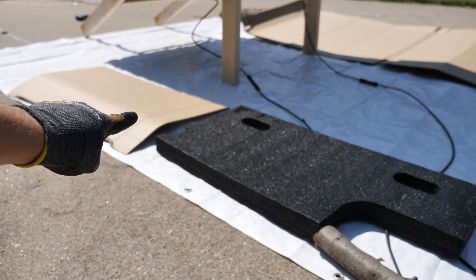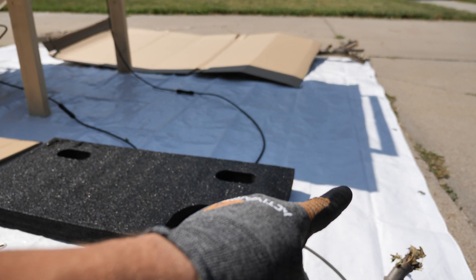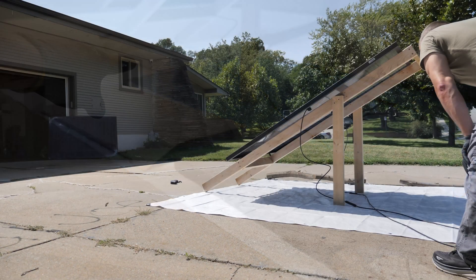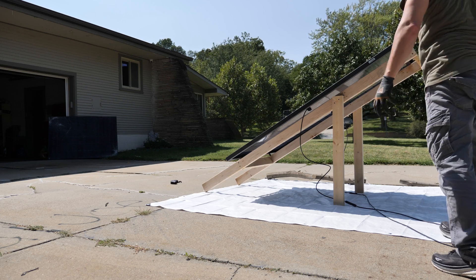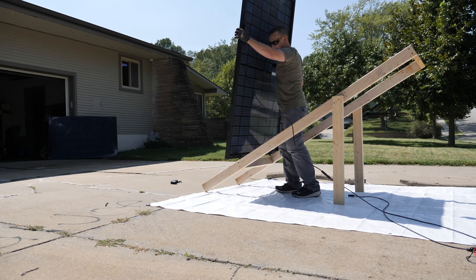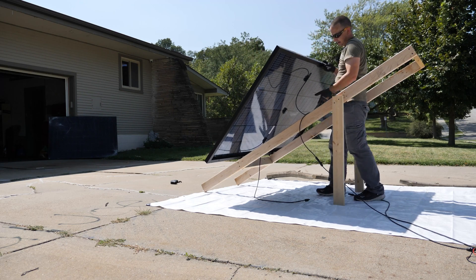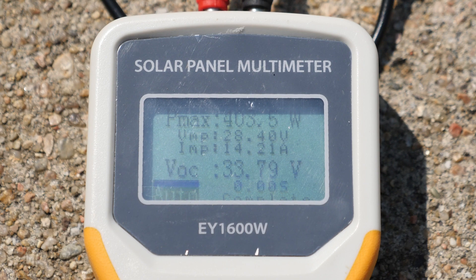I put a piece of cardboard covering the edge and a piece of foam on another side, leaving just a little bit of white directly underneath the panel and toward the front. We're at 382 watts with partial shading. I'm going to rotate the panel on its side and see if that makes a difference — the panel is definitely hot. We hit auto MPPT and got 403.5 to 407 watts — basically the same.